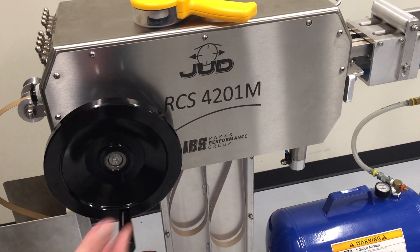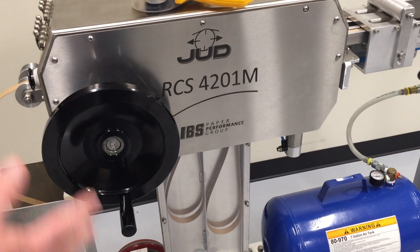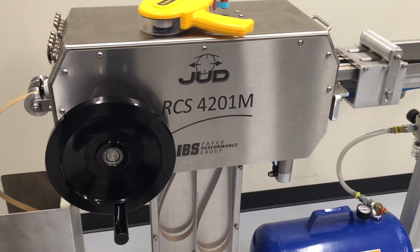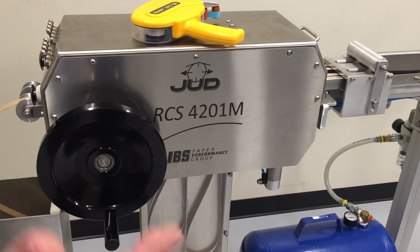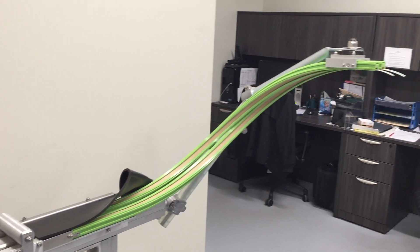The fourth switch cuts the tape and engages the injection button. At this time, the unit is set up and ready for a turn-up. When the time is right, the operator will roll the primary arms, creating a nip, and then inject the tape into the nip.